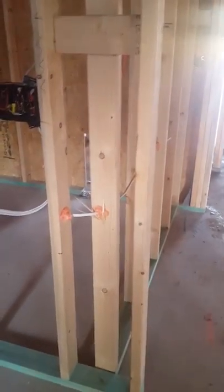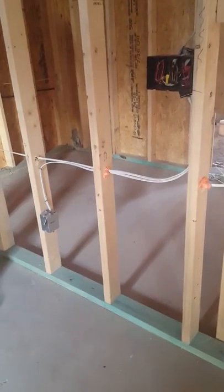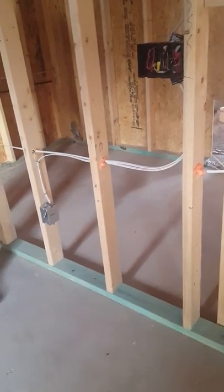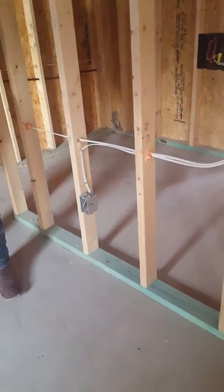Yep, I always recommend that you buy fan light fixtures that shine down. If you shine a light fixture up, what you're going to see is the critical lighting condition on a drywall finish. The best is to shine lights downward.